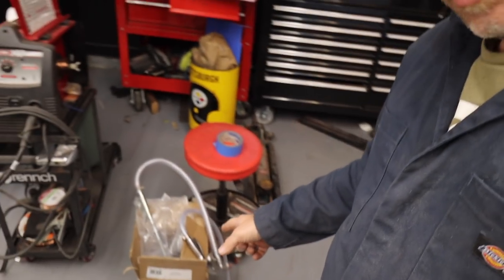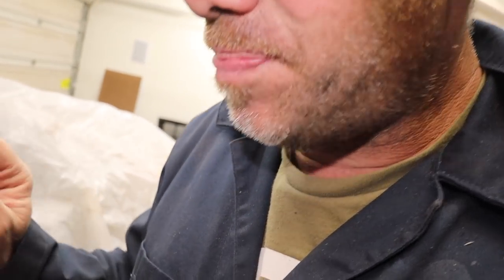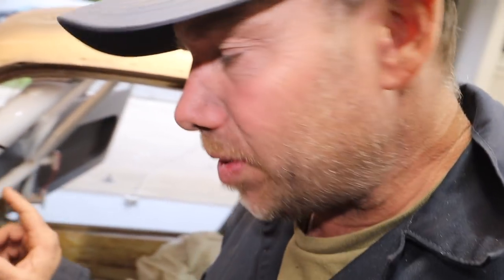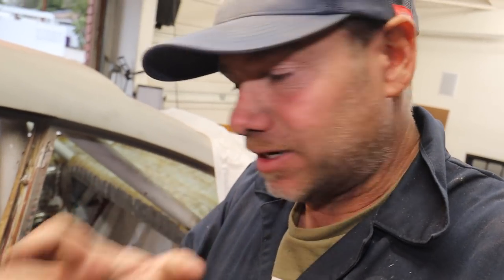I've modified it so I basically have just the hose and the sand — it's kind of portable. I have a few spots on this car that I cannot physically get any tool into but need to be paint-free, like inside where the rear control arms mount, in between little thin pieces of metal. The white paint that's on here now flakes off so easily. So I have to get rid of it so I can put a little weld-through primer on before building the outer section. I'm going to seal the car up, jump inside, and spot sandblast a few things. I'm going to make a colossal mess — it's probably a terrible idea, but that's what we do around here. We just send it.